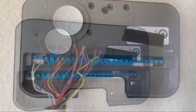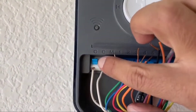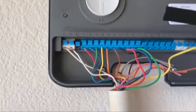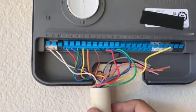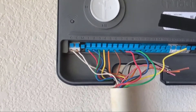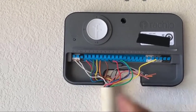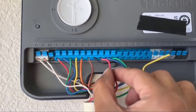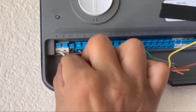Now I'll start doing the wiring work. The new controller uses spring-loaded tabs, so you don't have to use screws — it's very quick to push in those wires and fasten them. There all of them have been connected. One learning here: since I had all 10 zones, the PVC pipe is leaning more towards the left and right of the controller, so all the cables had to be pulled somewhat to the left. Make sure when you position the controller, you realize which cables you'll be using and centralize them as needed. Also, after installing, gently pull the wires just to make sure they won't easily come off and are clipped firmly inside the controller.